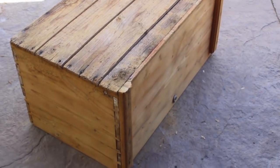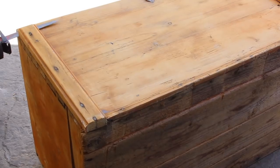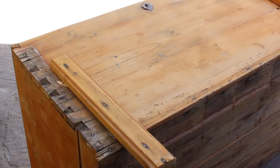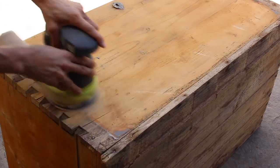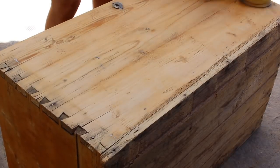I noticed the wood was too damaged by termites to keep it as is, so I wanted to cut that trim off and put a new layer on top since I couldn't just use wood filler to fill all the canals. I sanded it down once more when the trim was removed and then noticed there was some overhang on the bottom that I used my handsaw to remove.